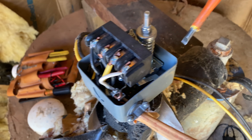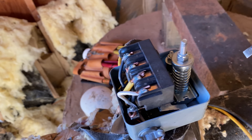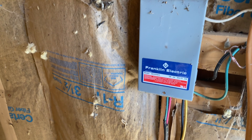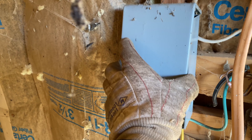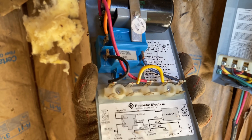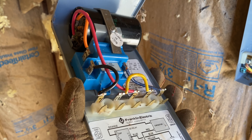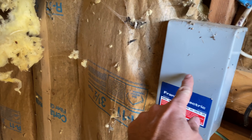Now when the switch activates, I can hear it - that pump trying to cycle right here, you can see the contacts there. That should be turning on the pump. Now that is feeding the yellow and the black wire, which go up to this Franklin controller. And this is where I'm not really sure what this does exactly, but it's taking the current from the switch and doing something. Something in here could be bad. I think it's this control box right here.